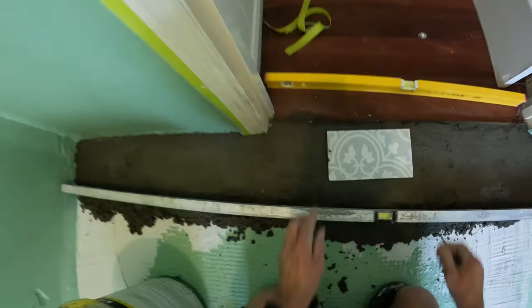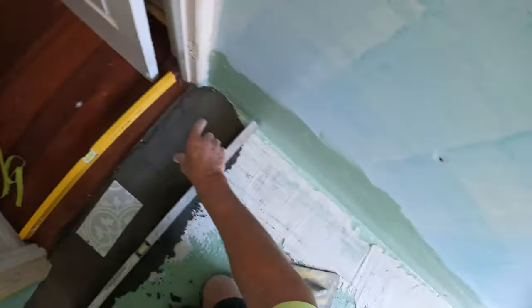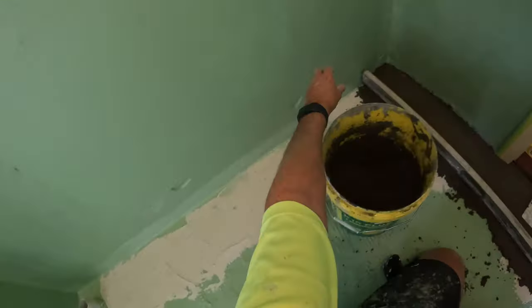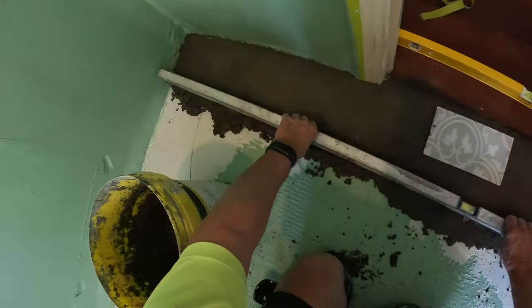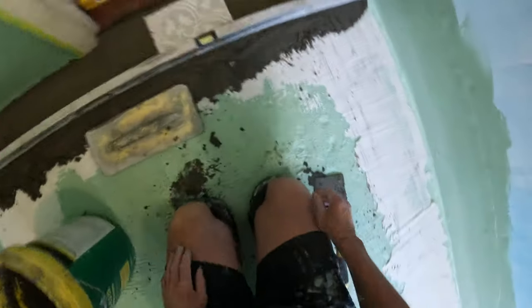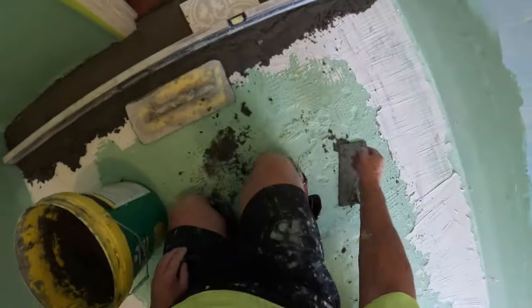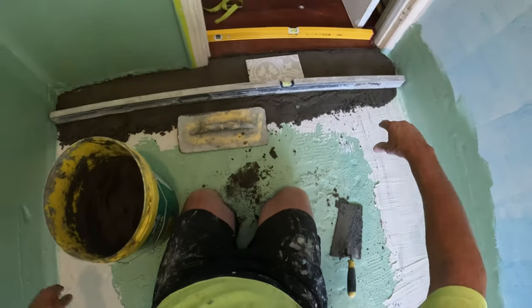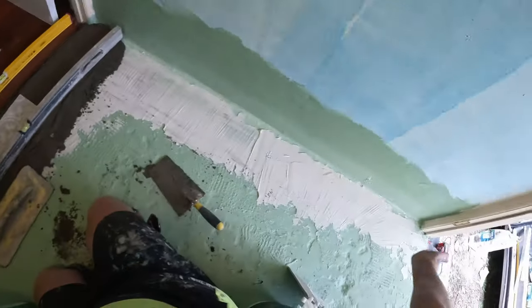What I now need to do is run my two rails on that glue down each side, and then all I do is drag it back. I'll be coming back to about here, then I can reach over and start laying my tiles and work out the door.